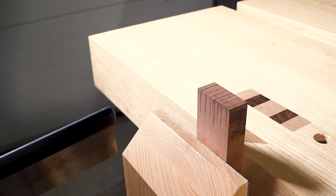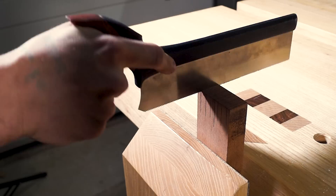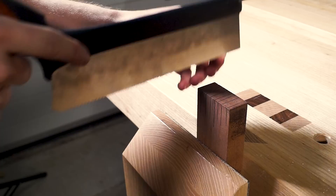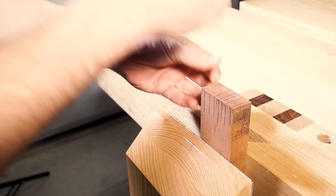With a western style saw you push forward to make it cut. If you drag back first and then try to push forward, the teeth sink into those marks and it makes it difficult to start - this causes you to jump outside of the cut and skim across the top. Incredibly annoying. Instead, what you want to be doing is focusing on doing a push cut, which works with the saw exactly as it's intended and gives you a smooth cut all the way through.